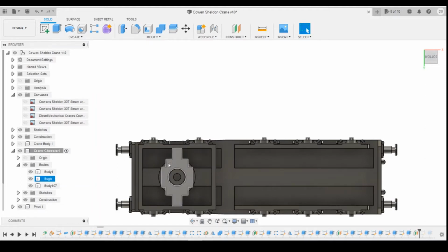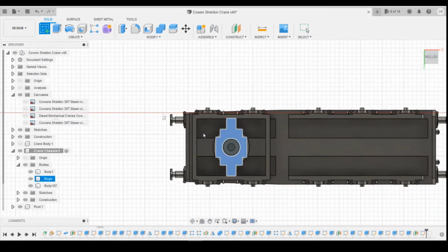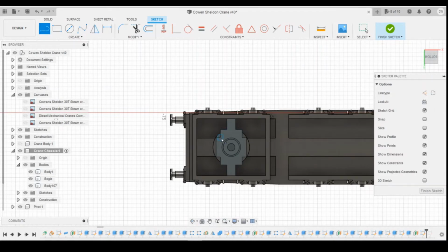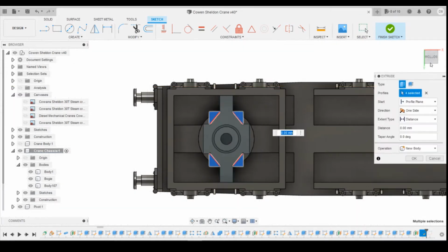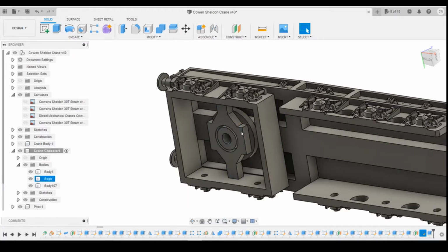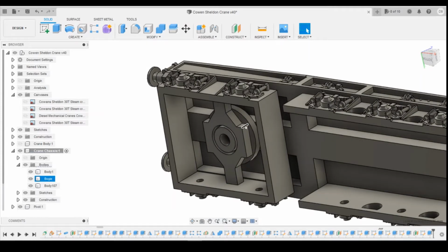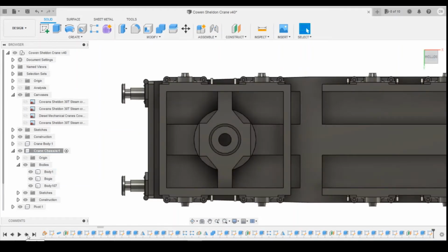Okay, so the next thing on the bogie motor is we're going to take these corners off here because this point in the corner was foul in the back of the wheel. So if we just draw simple lines across these corners here like this, and then we can select those 4 triangles and extrude them upwards. I think -4 should cut those. Yeah. And move through the history.